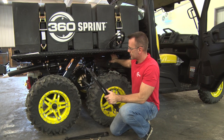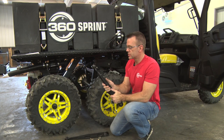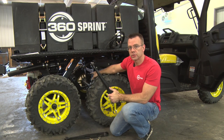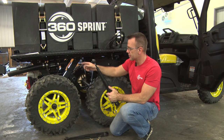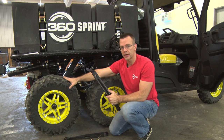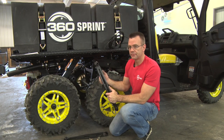Before we fasten the tank and frame to the gator itself, we want to install these linkages. What these linkages do is that it ties the bracket we installed in the hitch previously to the back of the tank and frame, and it'll end up distributing most of the weight to our rear axles, giving the whole machine a better balance.